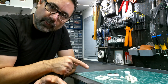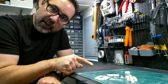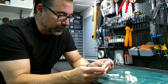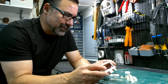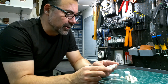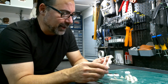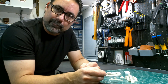Here are all the parts we're going to be using to make this animatronic eye. All of the parts were designed in the computer and then 3D printed. The parts are all made of ABS plastic, so they're a little bit more durable. I printed them on a strength setting, so there are lots of walls — most of the pieces are solid because of the wall thickness, giving thin areas like these good rigidity.